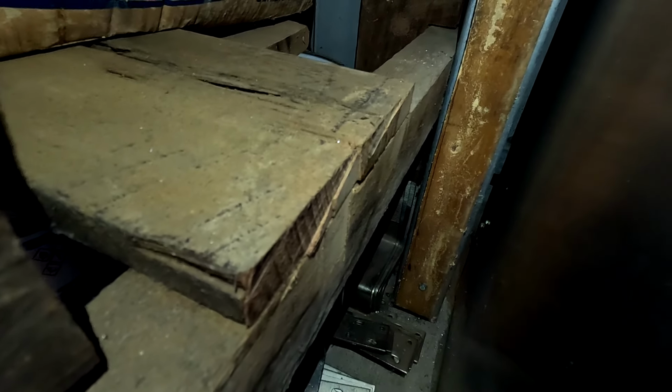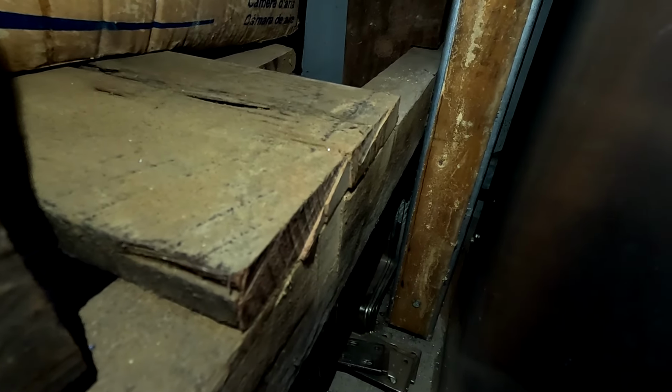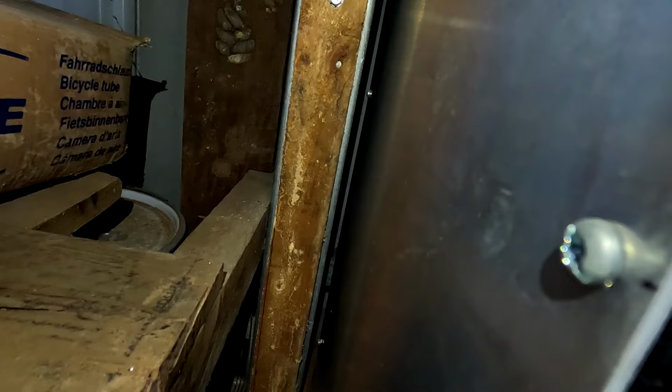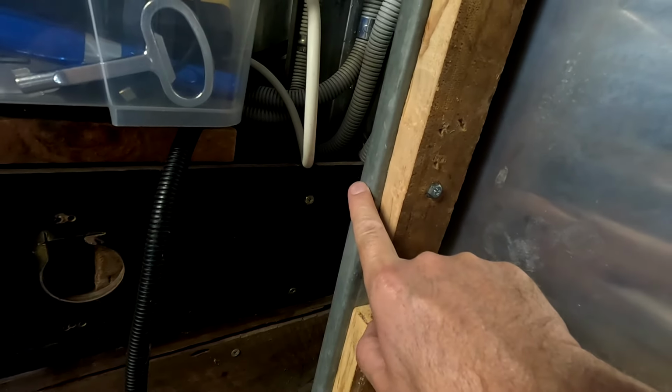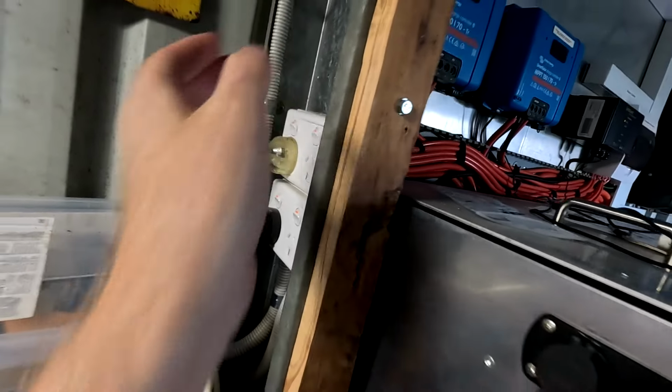This is hardwood, and it doesn't look super pretty, but this is all we get because there will be plasterboard coming in very soon. And it will go left and right of this stud there. And the plasterboard on the left can be screwed into the wooden stud, but the one on the right needs to be glued because there's no access. The battery shelf is just too close to this beam. I've just used the machine screws here. I tapped with M6 into the metal beam here. This is all bombenfest. And yes, I made sure that there are no cables on the other side, of course.